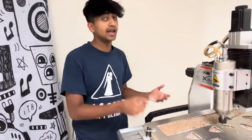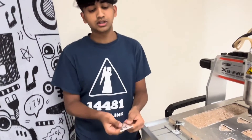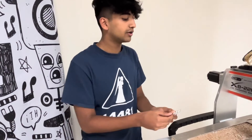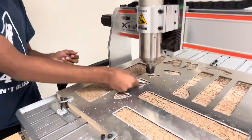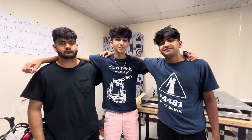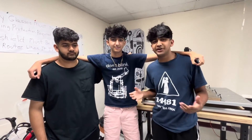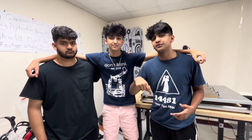Typically with larger pieces you're going to mount them down with screws to make sure they don't fly out when you cut the full product. However, in this case, due to the small size of this piece, we weren't able to mount it down and it still worked without flying out — just make sure you're careful with bigger pieces. Thank you guys for tuning in to another Don't Blink tutorial video — make sure to like, subscribe, and smash that notification button. If you have any questions, reach out to us on Discord and we'll put all our socials down below.